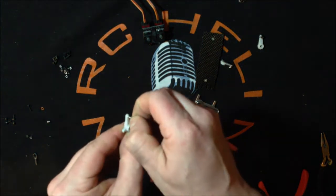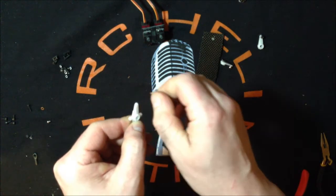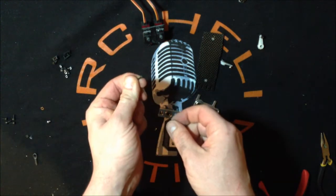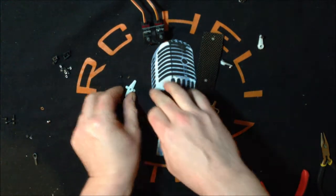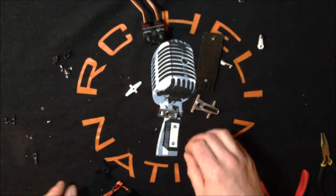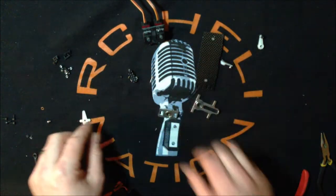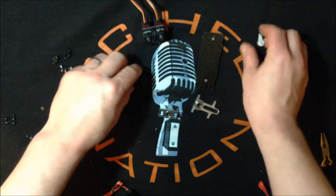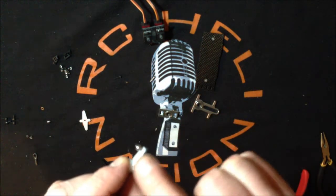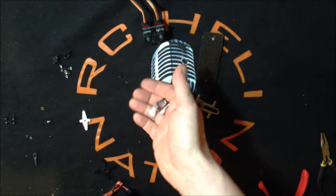I went in here and then used a screwdriver and drilled that through, and that kind of opened the hole up a little bit, just did it nice and slow, and then went in there, put some pressure on, and got this screwdriver in there, got that to go through, and then with that being flat, took the little black nut and put that on the other side, and that's how we ended up getting three of these really nice strong servo arms, where, remember, it's flat. So make sure you take the time to do that right.